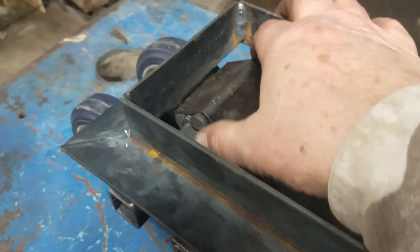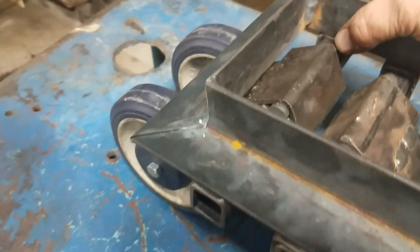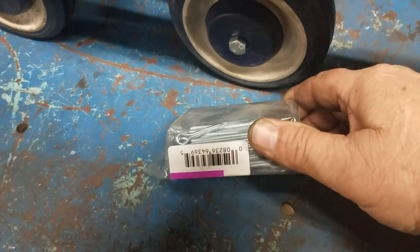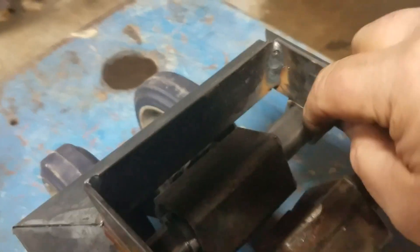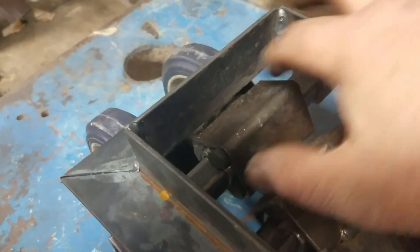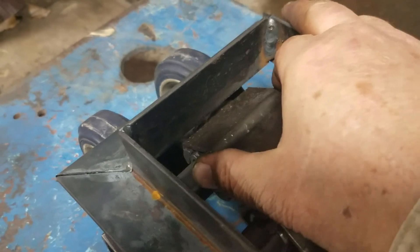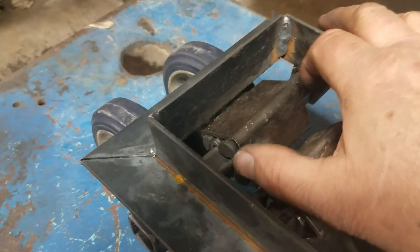The arms slide but they don't rotate because they're tight — that's square tubing with real tight tolerances. Even the bar stock here will slide out. So what I'm going to do is put a cotter pin — three-sixteenths cotter pin by two inches. Drill a hole here and here — this will be centered. Drill a hole here and here. Cotter pins on each end will keep the center square tubing from sliding back and forth in the brackets, and the other two will keep the arm itself from sliding on the square stock. Four cotter pins — pull them out and you can slide the whole thing apart.